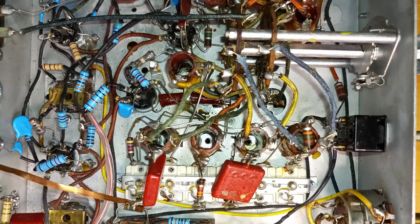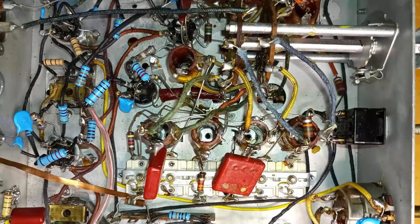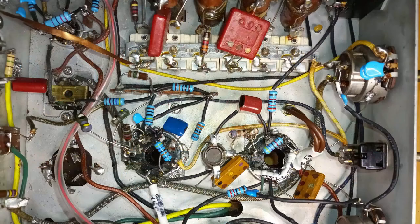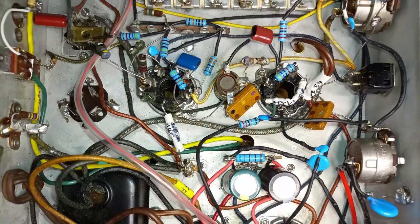This radio receiver has been designed taking into account also the temperature drift, choosing the components so that this effect could be compensated. If these components were replaced, the overall temperature drift compensation design would not work anymore. Anyway, in the radio frequency section remain questionable components, like ceramic disc capacitors and all the resistors that might be replaced in the future if the drifting compensation mechanism proves to be not working anymore.